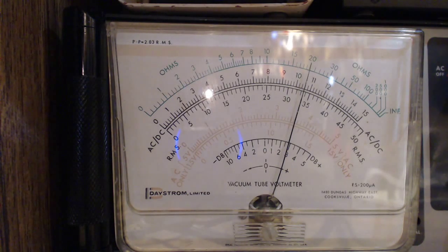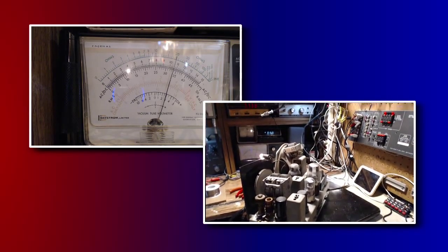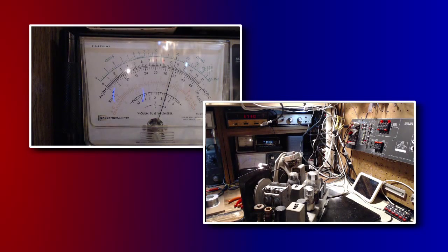That's more than there. Have a look at that. What's going on here? There, you can see the frequency. So I'm going to change the signal generator frequency. Doing nothing to the AVC voltage, so it's not from this signal I'm feeding into the antenna. Tune the radio here. As I tune the radio,